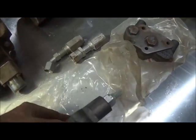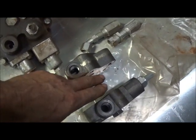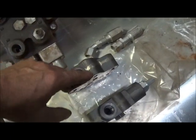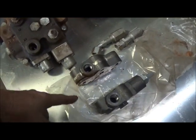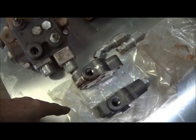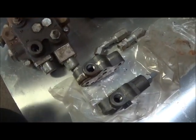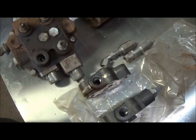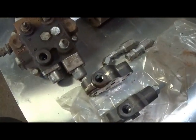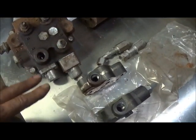These are good, simple valves — they bolt together. It's called a stack valve unit. This is your inlet, this is the outlet, and these would sit together like this. You can put dual-acting or open-center control valves in here, and add them with the bolt kit — sort of like a threaded rod. O-rings go between them. You can get a single-acting valve, which would be a cylinder that pushes and then gravity brings it back down, or a double-acting which is push and pull. You can actually get this in a closed system where your fluid doesn't run all the time, depending on what pump you're running. You wouldn't run a closed-system control valve on a regular pump like we're running because you'd be creating a pressure bomb. But that's what we're using and that's how the control valves work.